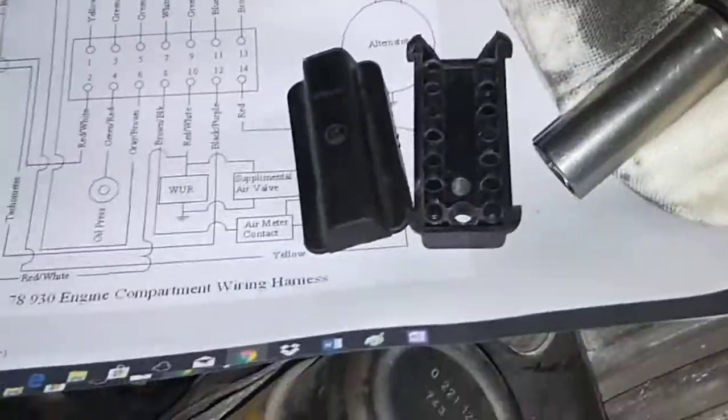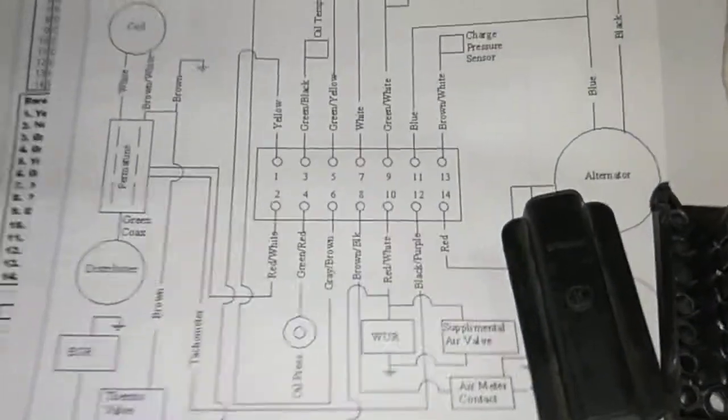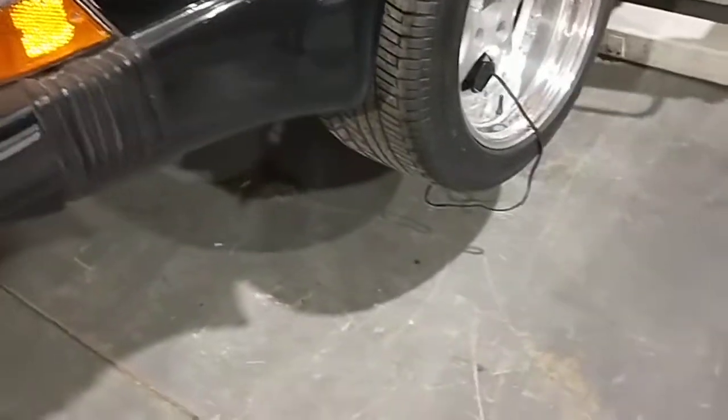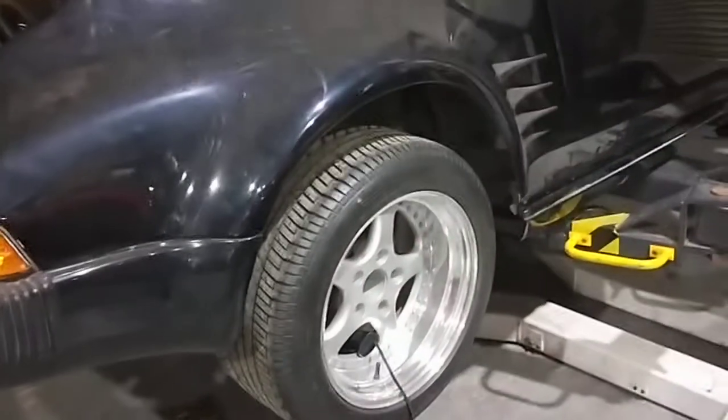So there's no need to turn this over and plug the wiring into here. There's no need. I've got the wiring diagram there. But there's no need to do that because the starter motor is not even turning the motor properly. Alright. So there's a lot of work to be done before I've got to put the starter motor out, have a look at the ring gear, make sure it's connected. And the other stuff as well.